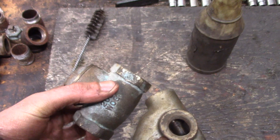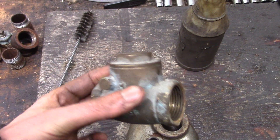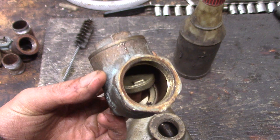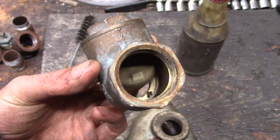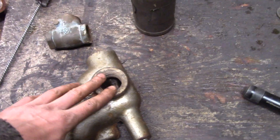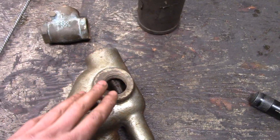So I took this out. I feel that you're working off 11 inches of water column — that's roughly one-third of a PSI — and it takes a certain amount of force to open that swing check. Not very much, but if it's only a third of a PSI, that might make a difference on how it runs. I'm just going to run a straight pipe with the diamond valve, and that'll be nice and clean instead of a whole hodgepodge of fittings.